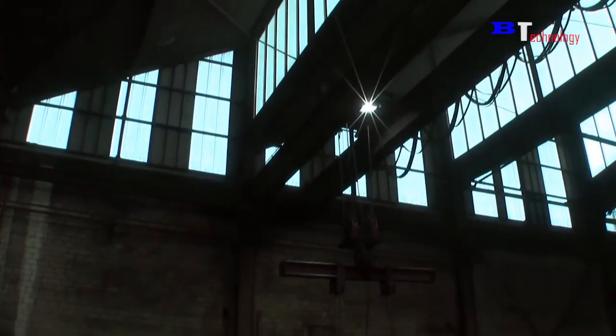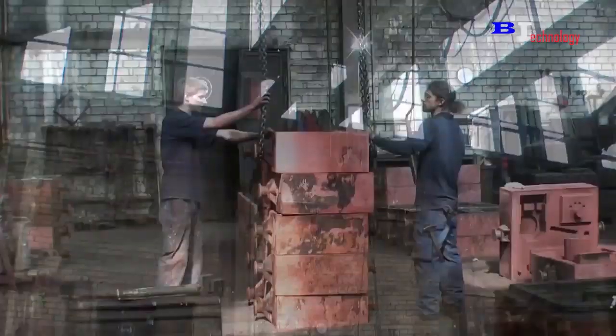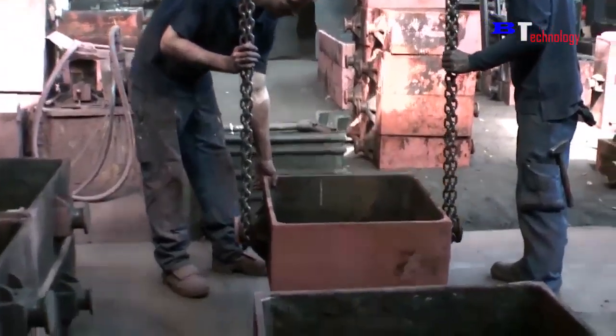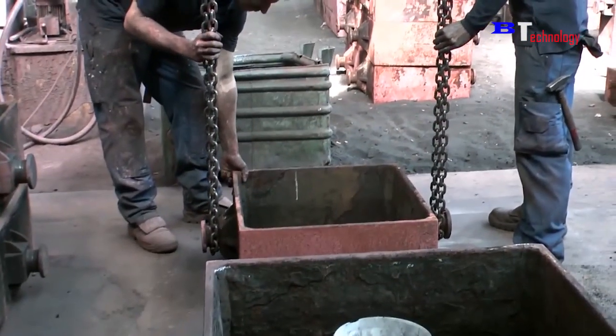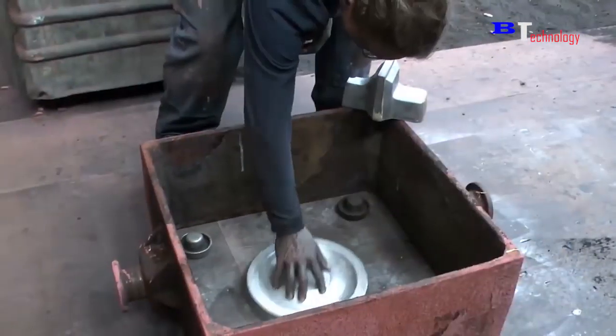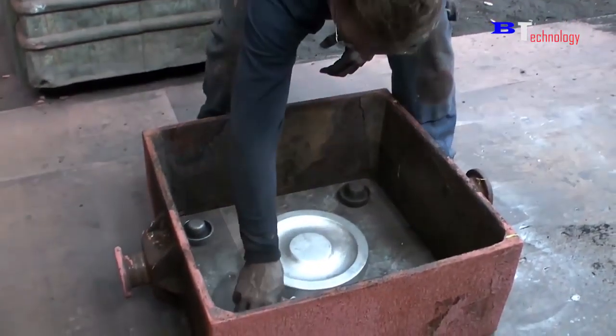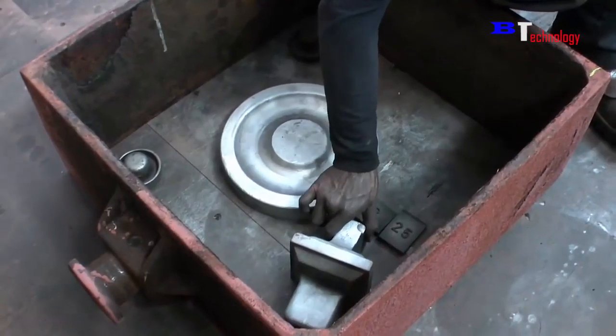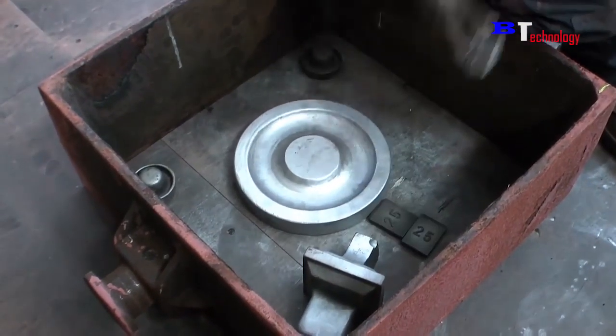Sand casting is a popular form. Sand molds are one-time molds, pouring only once and then breaking the mold. Sand casting in a sand mold has low accuracy, poor surface gloss, and a large amount of machining. But sand molds have the advantage of creating castings with complex structure, large volume, and low mold cost.